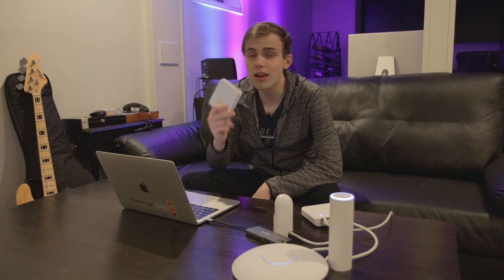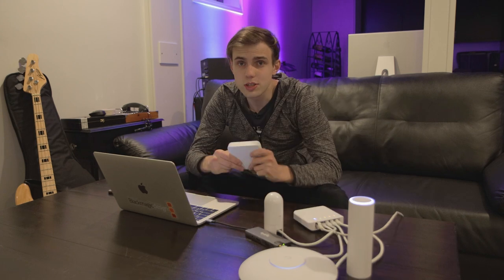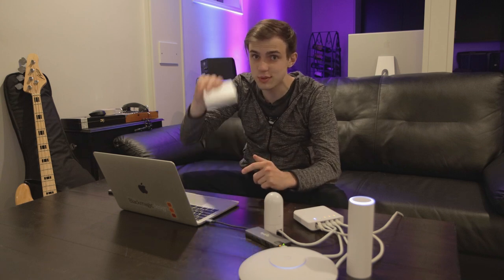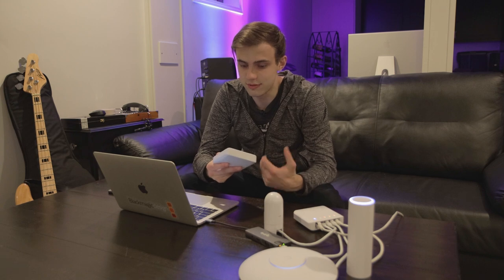This switch from my bedroom provides PoE to all the devices in my room because I have ports built into my desk. I have three of them deployed here at my house. This fourth one is going to a small business I do MSP work for — it's going up in the drop ceiling, powering two access points, an IP phone, and sending networking to a port in the wall. With it being a managed switch, the phone can be on the voice VLAN while still sending all VLANs to the access points and controlling the VLAN going to the wall jack. To recap: for a hundred US dollars, this can provide PoE to four devices while being powered by PoE itself. It's great for splicing into existing installations where you can't run new cables, and a fantastic value at a hundred bucks. They've made my life a lot easier, and if you're anything like me, I'm sure they'll work for you too.